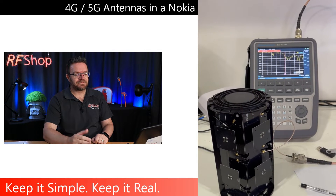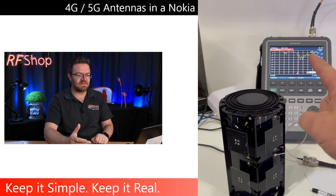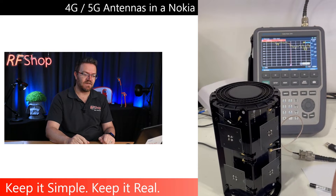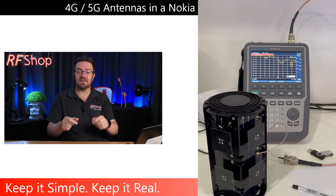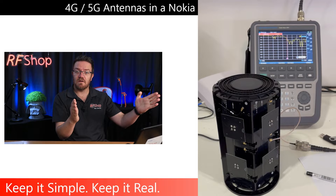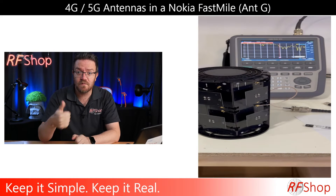In the video you can see me move my hand close — within 20 to 30 seconds, you can see it making a lot of changes on the screen at the back, which is the VNA. When I went from the side of that same antenna, nothing happens, which is a great sign. It means that when you look towards it, it's very responsive; when you come from the side, it's not doing much — it's all focusing forward. That's what you want.